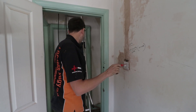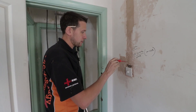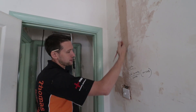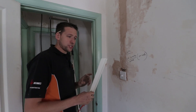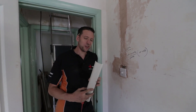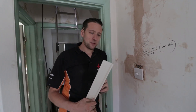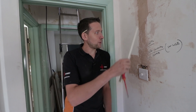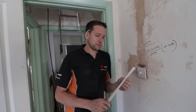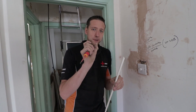We've got to chip these out. Tom's upstairs just drilling his way through the joists up there to make way so we can sink the cables in so they can board the loft. I need to chip these out because I want to put some capping in. That does remind me — I didn't think it would create as much of a debate as it did, over whether you should use capping or oval pipe when you're putting cabling in the wall. It was literally 50-50 — half of you were saying use capping, half saying use the oval pipe.